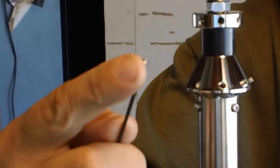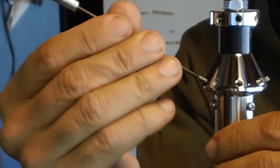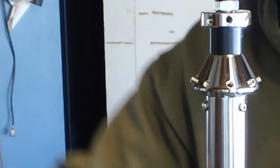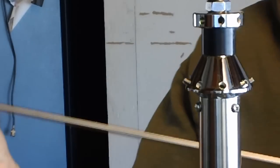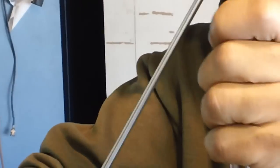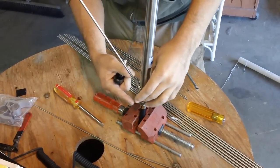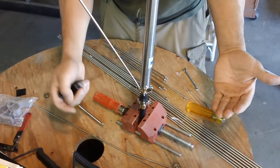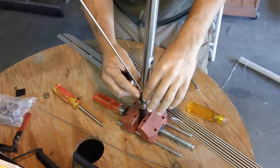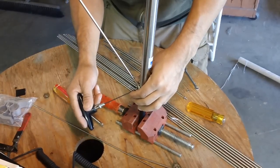You have a screw in here to screw in the skirt part, or the cone part of the discone antenna. These holes here are where you screw it in — that's what sets the poles in place. You take the longer pole and stick it in towards the bottom and tighten it down. I had to do the cone part first because if I do the disc first, I'll have a difficult time getting my tool in there to tighten the skirt.